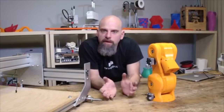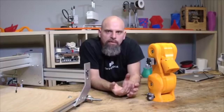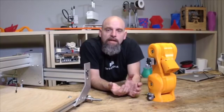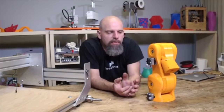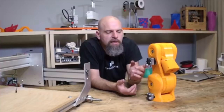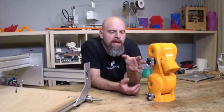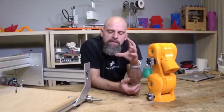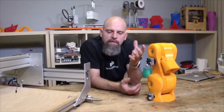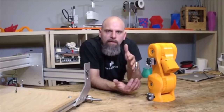The cool thing is, if that were perfected, and this guy on YouTube is trying to perfect it, you could put a $5 quadcopter motor in there and get an enormous amount of power, way more than a brushed DC motor could do. But a lot of people are just using steppers, because steppers are pretty strong, so you could do a 4, 5-to-1, 7-to-1 ratio and get quite a lot of power and no backlash. He's using what's called a wave gear. Anyway, he explored that and got quite far down the road.